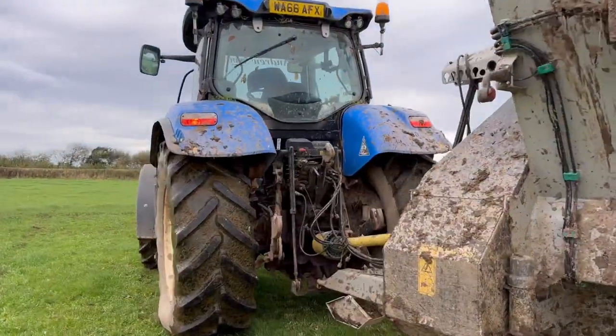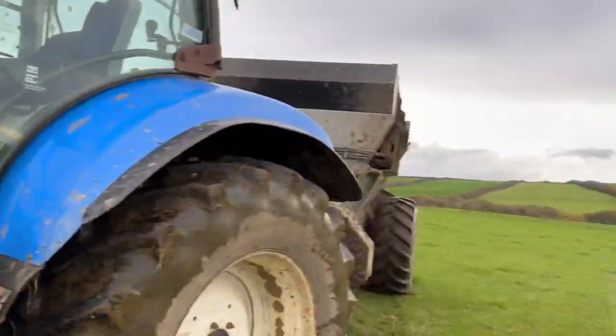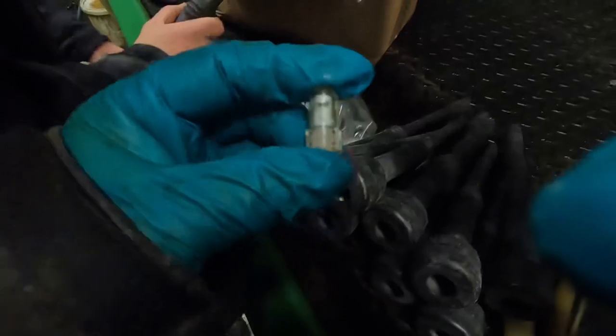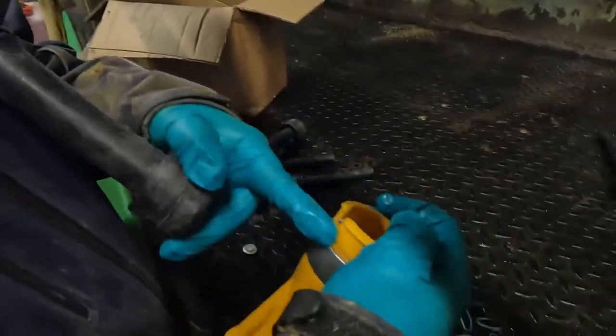Let's get back in, pull it off again. Changing liners — best job in the world. This is a liner; after so many milkings we have to change these. These little things put teat dip on and disinfect, and that bit we've got to line up with that bit — see the arrow.